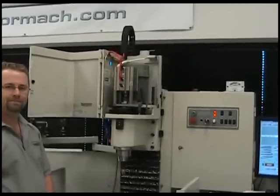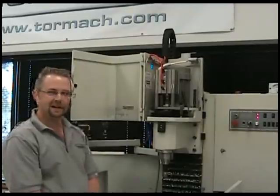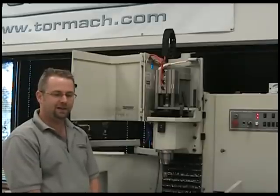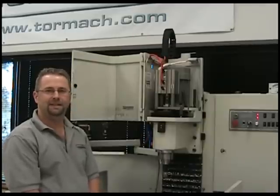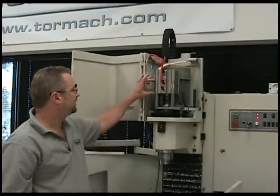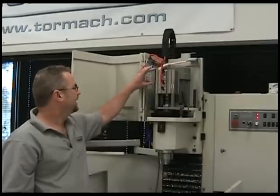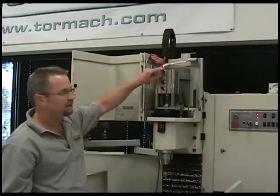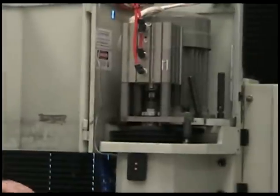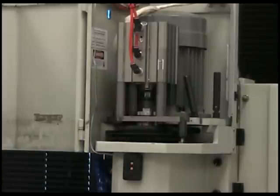Why the air-over-air cylinder? Well, there are a number of different ways you could do it — straight hydraulics, air over hydraulics, or just air. We felt that while hydraulic systems can be more compact for the given load they're applying, they also add an extra element. We like to keep things simple, so a double-cylinder pneumatic-only setup was the best way to go. This is two cylinders pancaked on top of each other — essentially two four-inch cylinders. They're linked mechanically through the rod, and we pressurize both ends for the downforce, getting two four-inch cylinders pushing on the same point. It's a simpler setup, one less media to deal with, and it still fits into our working envelope of the 1100.